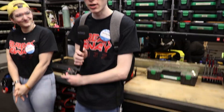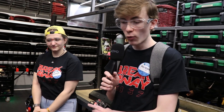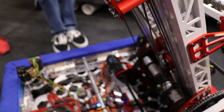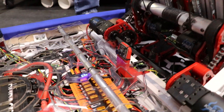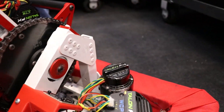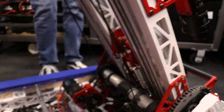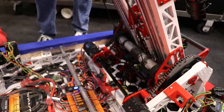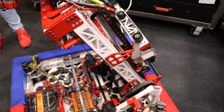So one thing we really wanted to focus on this year with programming was making sure that the driver could operate the robot very efficiently. We were looking at a very efficient auto-aligning system, and so using PhotonVision this year with an Orange Pi, we have one camera here in the belly pan of our robot facing forward so we can see the tags on the reef, and one camera right here facing backwards so we can see the coral station tags. By using those we can estimate our pose on the field and then the robot can autonomously drive to line up with each branch of the reef and also with the algae branches, so the driver just has to focus on where he wants to go instead of actually getting there accurately.